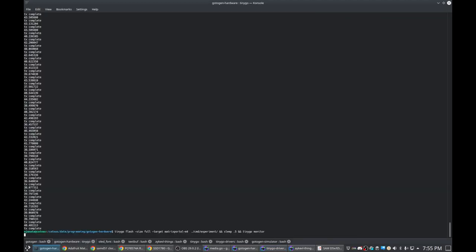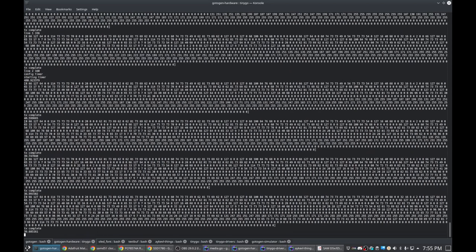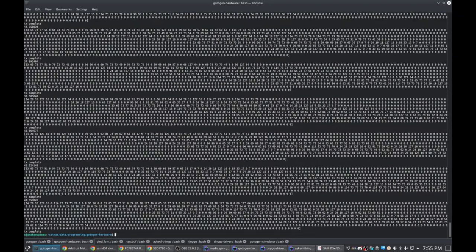So now I'm going to have it print the buffer that it's trying to send every time it sends it, just to make sure that there is reasonable data in said buffer. Which, that looks reasonable to me. The zeros are off pixels and the numbers mean that some pixels are set. It doesn't look like that's necessarily the same thing every single time, but it's hard to tell just by looking at the data. Okay, that's definitely not the same thing every single time because some of these numbers are different.